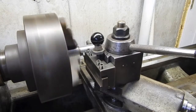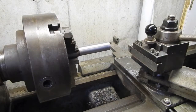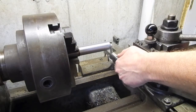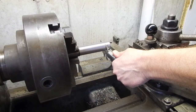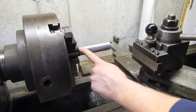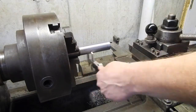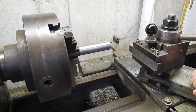A lot of chatter marks in that cut now. Oddly enough, just last night I made the cut I just showed you which was smooth as glass, and haven't changed anything other than tightening up the jibs - although I was taking a heavier cut. That's 234 thousandths on the end; going in a bit because of the roughness: 236 and a half, 235, 233 and a half, 235 and a half - about two thousandths. That's weird.